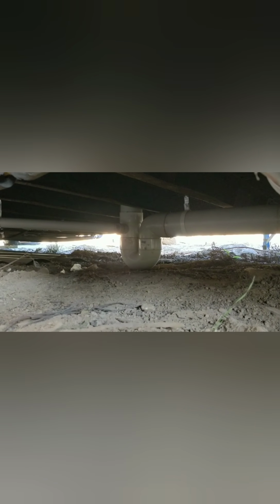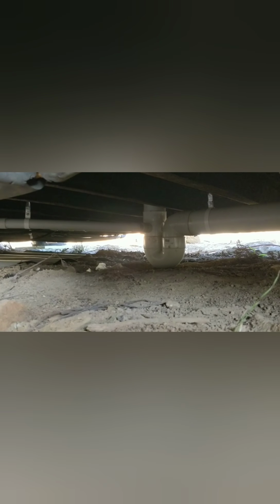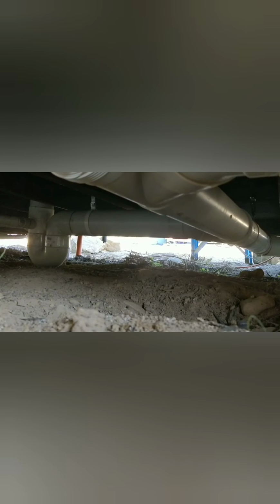As I said, they didn't want to do it. Oh, floor waste, you don't have to put them in. And after he thought about it for 2 seconds and started doing it, he's going, oh, this makes it really easy. Alright, well, duh. So anyway, there we have it. So there's bath and vanity into the floor, so a 4 adapter at the floor waste there, S-bend for the floor waste. Coming through, we pick up our toilet waste right in front of me. We take a right-hand turn.